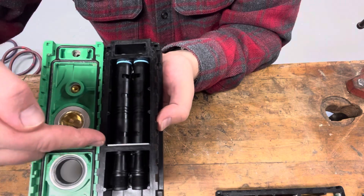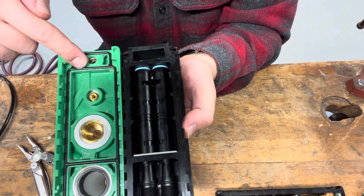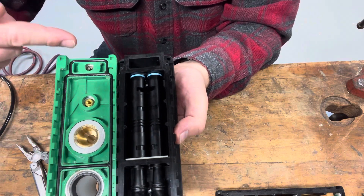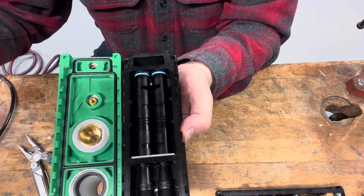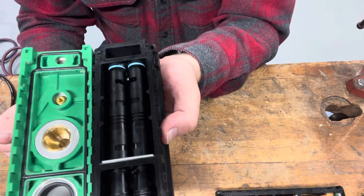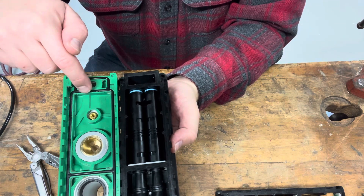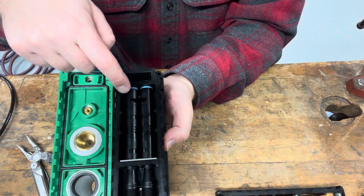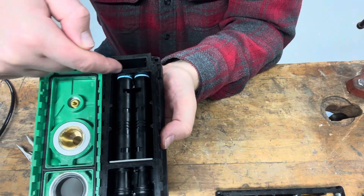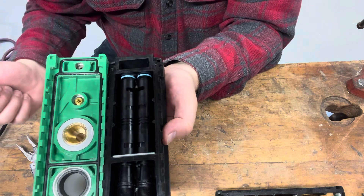It's really important that you've got this gasket completely intact, because if not, you're going to have the pressure bleeding into the vacuum or the vacuum bleeding into the exhaust, and you're going to have a major loss in vacuum. So it's important to make sure that that gasket's all intact. And then also with these cartridges, there are O-rings between here and here to make sure that air is not passing between each section.